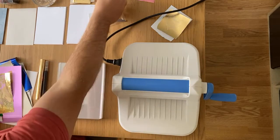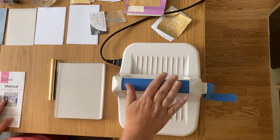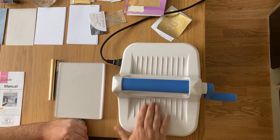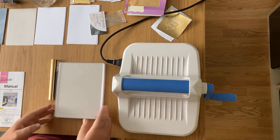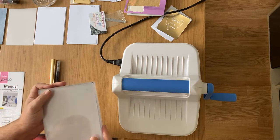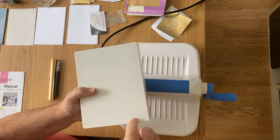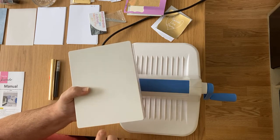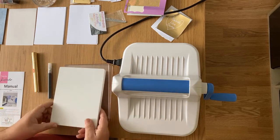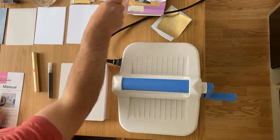Without further ado, let's get going since it's now up to temperature. It's not hot around the machine on the bases, but don't put your hand through the hole where the plates go. Also when the heater is on it takes a while to cool down when you turn it off. Never leave your plates under there even slightly because if the roller is touching it will start to melt the plastic. I know that because I've got a little dip on mine now - that's why.